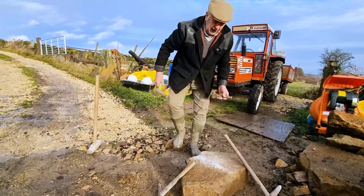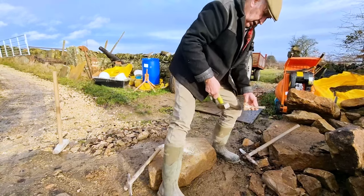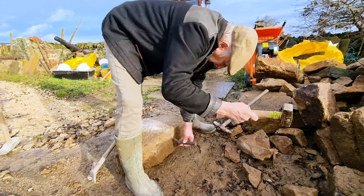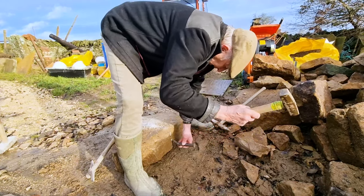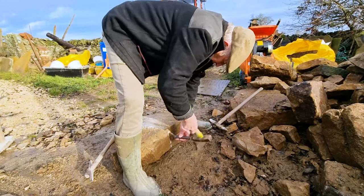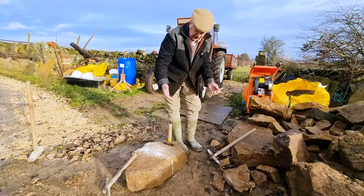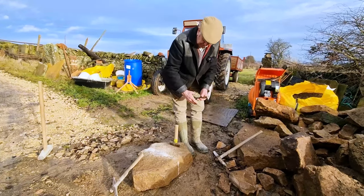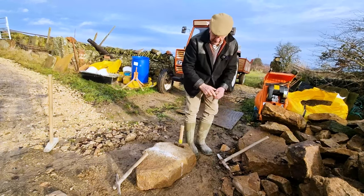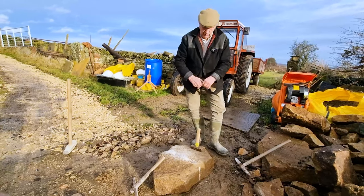You can go with your nicking chisel and cut down the sides, which could help to guide it. But you always try and cut a stone in the middle, because delving means divide. If you try and cut a bit off one end it could just scalp out like that, but if you cut it in the middle the resistance is equal on both sides.